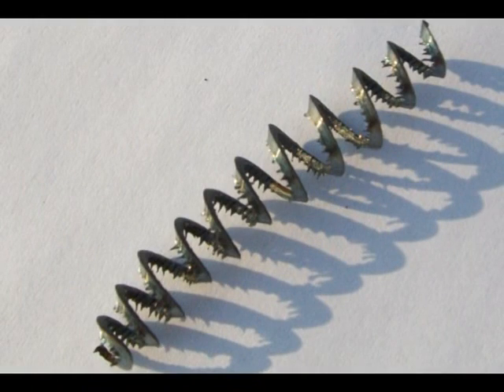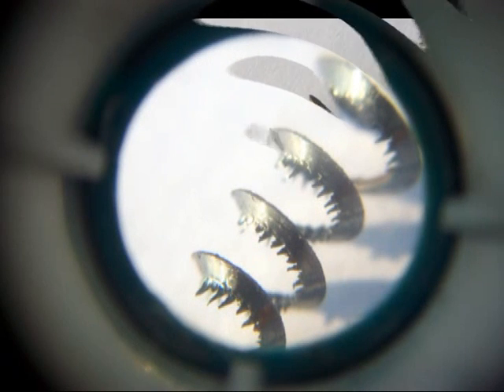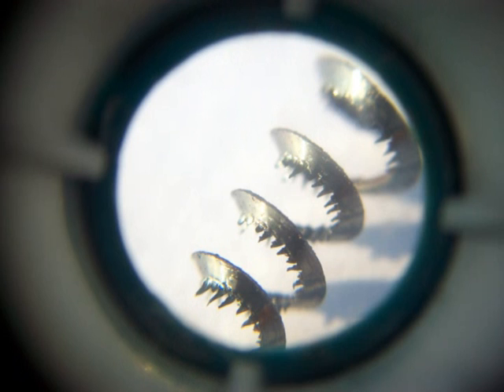Although it looks like a continuous serrated chip, it is not. Here the pointed metal extending from the side of the chip is formed when side flow of the chip takes place. These are formed at cutting speeds as high as 800 rpm and a depth of cut ranging from 0.5 to 1 mm.